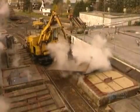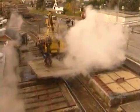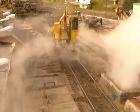The first factory makes the doors' plywood facing. They start by loading logs into steaming basins for 3 days. This de-ices them in the winter and softens the wood fiber.